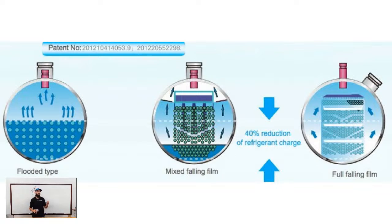So it's really critical that you're monitoring your liquid level in the evaporator and that it's not getting too much. One of the ways you can see that: centrifugals don't monitor literal suction superheat, but they have discharge superheat. So if you begin to see your discharge superheat run really low for any reason, you need to start evaluating what's going on in the evaporator, because it may be having an issue that's leading to that.